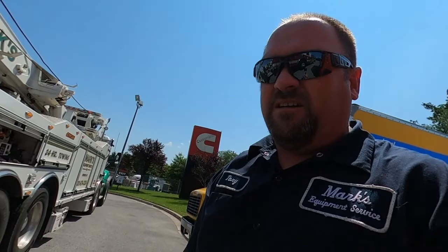I've done it before with a wheel lift, and it works that way. I don't like how the truck bounces, and the fire truck also bounces really hard on that wheel lift. You go over a bad bump, and I almost feel it could be worse towing it that way because of how hard it's stretching and compressing that suspension very violently. And it throws the wreck around a lot too.